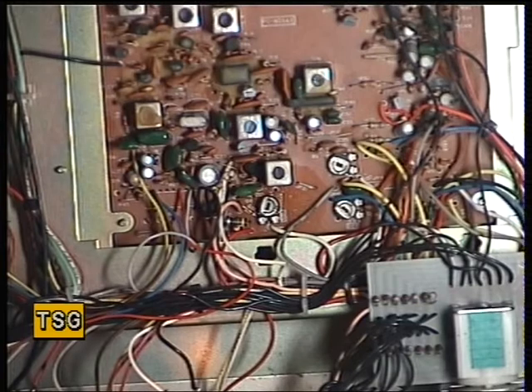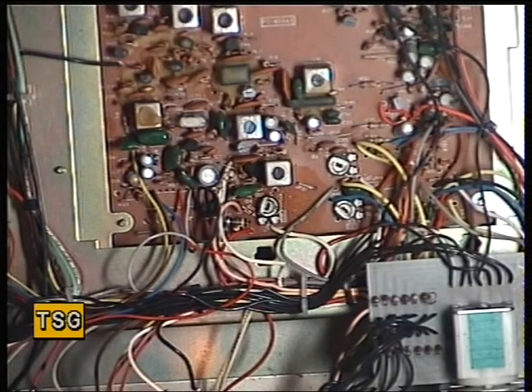That's coming in — I think the best is one microvolt; I'll just test again. Set the threshold, generator on — three microvolts. That looks to be as good as we're going to get that. Mind you, I don't think it's as insensitive as the Jason KT3003 we did the other day. So, that concludes setting up the receiver of the President KP77. We'll put it back together and put it on the air.